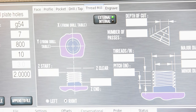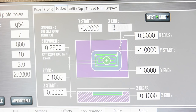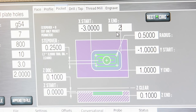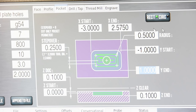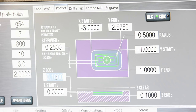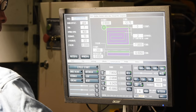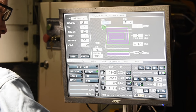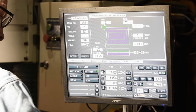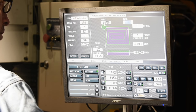Using this little interface you can tell the machine to do things like mill out a pocket, face off a part, or drill some kind of simple pattern. This is known as a conversational interface — conversational because, gosh, it's so darn easy it's like having a friendly old chat with your little machine. It probably seemed that way 30 years ago, but now it seems a little primitive. And all joking aside, it's actually quite useful.